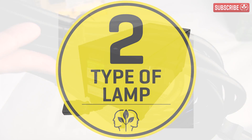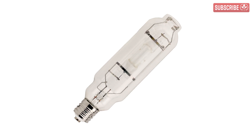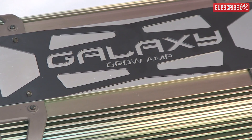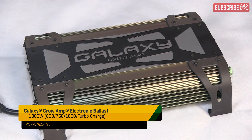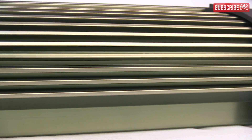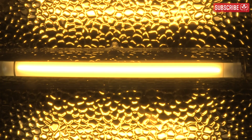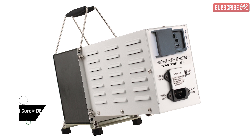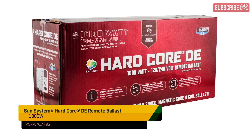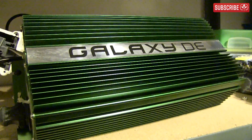Number two: what sort of lamp do you need? Back in the day, you had to buy separate ballasts for HPS and metal halide lamps, or buy conversion lamps to use one with the other. Your modern-day e-ballasts should run both metal halide and HPS. The Galaxy Grow Amp will run metal halide, single-ended HPS, and double-ended HPS lamps, all at super high frequency — over 100 kHz. The Hortelux Platinum Ballast and the Diva by Revolution Micro take a different approach and run the aforementioned lamps using a low-frequency square wave. This is handy as they can run the new double-ended CMH lamps too. Also note that you can now run DE HPS lamps on magnetics — I'm talking about the new Sun Systems Hardcore Ballast, which is proving very popular right now — but anyway, back to electronic ballasts.